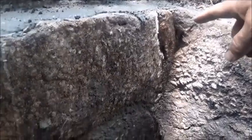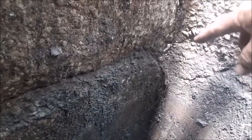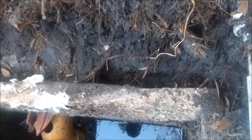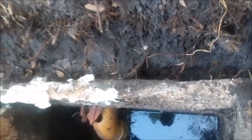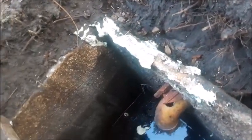You can see in this corner how the crack actually comes down and comes across right here. There's actually some roots coming through the side of the septic tank wall, and this is about 12 inches down from where the actual lip is. So what we're going to do is dig out behind the back side of this wall and backfill it with concrete.